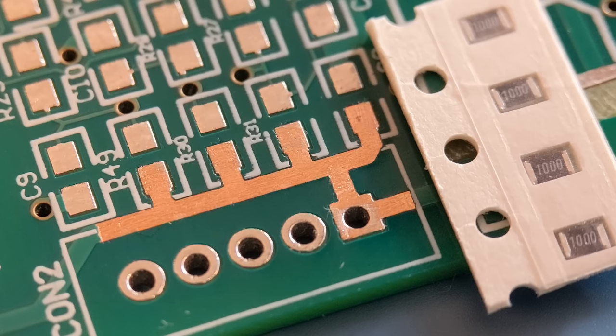If you flux it and solder it as per normal, you're going to get flow of solder down onto the trace. And if you're doing an RF board — radio frequency board — too much solder going to points where you don't want it can really affect the performance. So this Kapton Tape will stop that happening. It's a great trick to know. I've used it quite a lot recently on RF boards, so let's get on with the first demonstration.